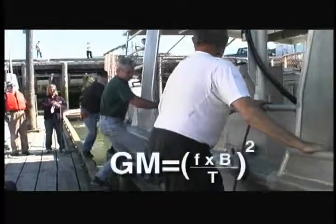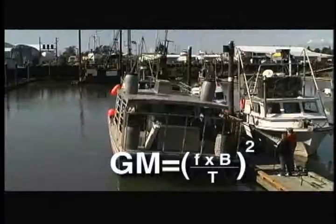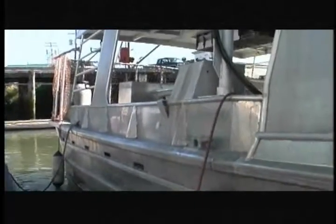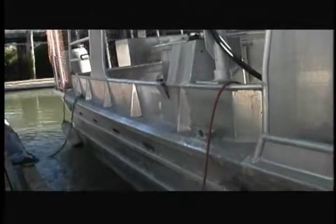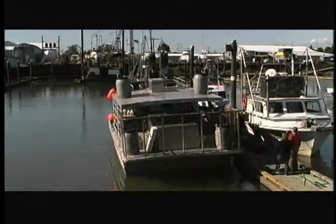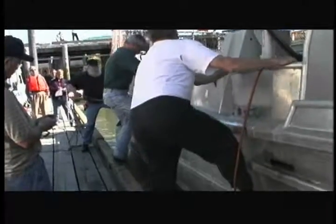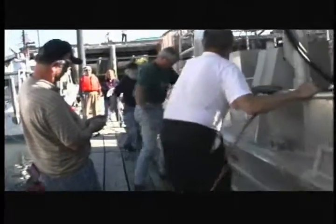"What about the other test that you did?" "Roll period test. We measured the period of roll and put it through the formula that Transport Canada provides for fishing vessels." A roll period test determines the length of time it takes a heeled vessel to right itself. The vessel is heeled and its progress to complete one full roll cycle is timed. Changes to a vessel's roll period are a rudimentary way of evaluating whether the vessel's stability is degrading. If roll period times are increasing over the life of a vessel, it is an indication of the vessel becoming increasingly unstable and that further assessment should be undertaken.